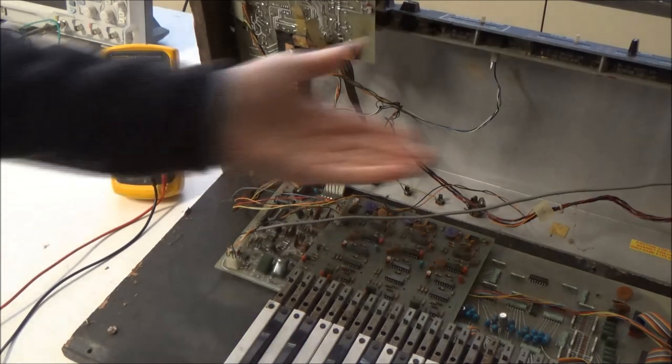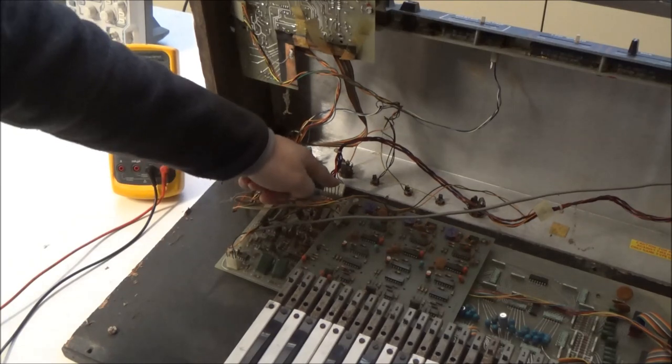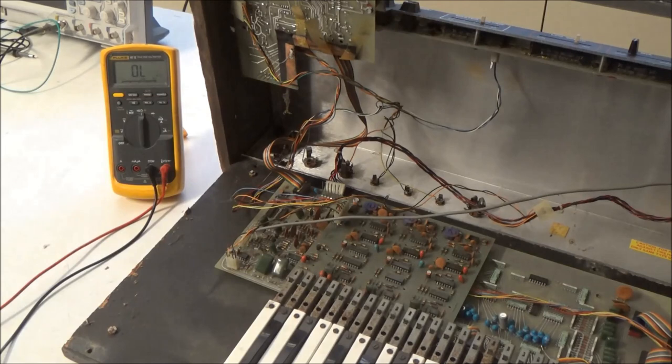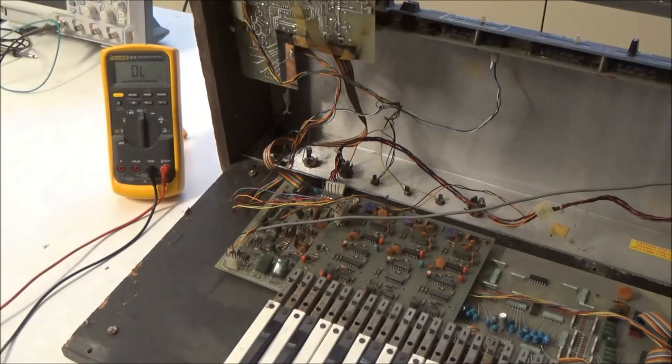Normally, if it were a power supply issue, we could just hook the boards up to a bench power supply. I would not bypass the fuse and or waste another fuse by using the original power supply. And maybe we'll do that after we find the short. But I think we can find the short probably without powering it on. That way we don't damage anything else.